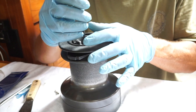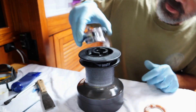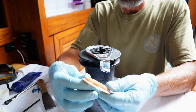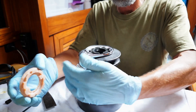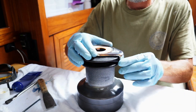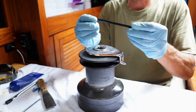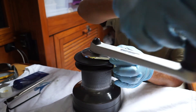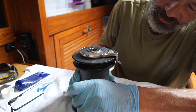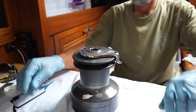Here's the rope stripper. The tailing arm goes down over top of the rope stripper. And the homemade piece that took me forever and a day to make — that keeps the tailing arm from spinning around like it did when I got it at Blue Pelican. That goes right here. Drum spins, the tailing arm does not spin anymore. Top cap, center hub unit, quarter-inch Allen wrench. They asked $125, I got it for $50. I put it back together, made a little part out of epoxy and fiberglass, and it's basically a brand new winch.